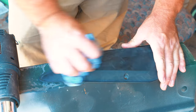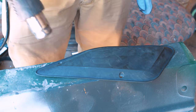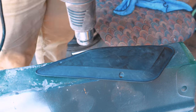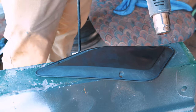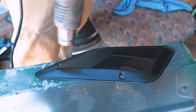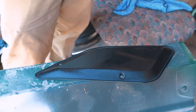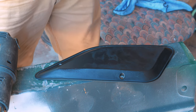Of course, you want to clean off your plastic first. It's actually pretty simple. You just set your heat gun to the hottest setting that you can and get it as close as you can without burning, and you move right along. You're waiting for the surface to start looking wet again. You don't want to stay in one spot too long because then you might warp the plastic.